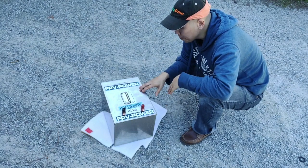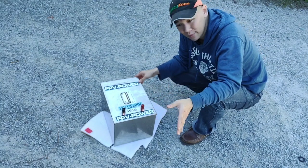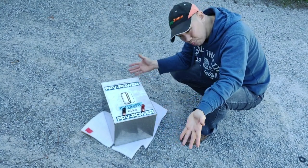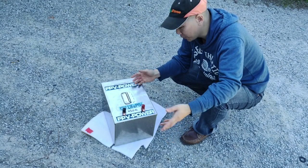So with this, a 440 amp hour lead acid deep cycle, he could only utilize 220 and still have a good life cycle out of it. I think he had those batteries for about 5 years, so a pretty good run for his money. And that's all based on how often you discharge it, how often you use it, of course.